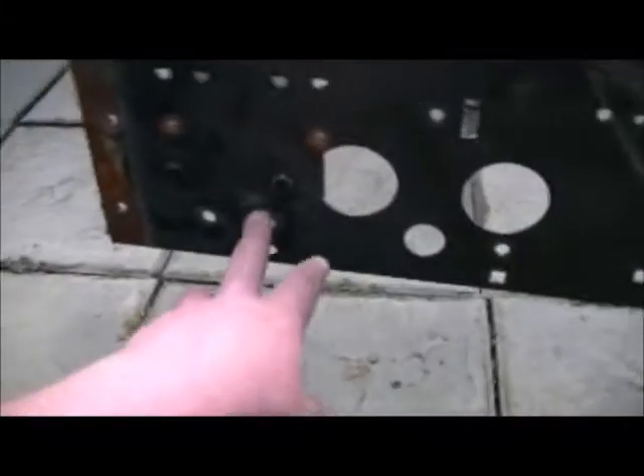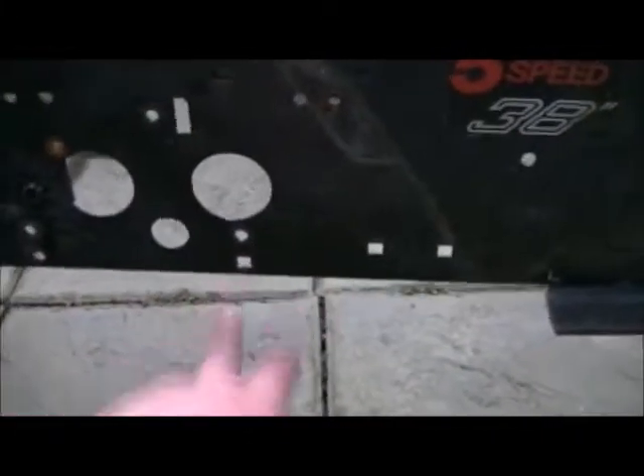The reason why I had to cut the front so short is because of where I'm putting the rear end. The stock rear end for this would have been these back holes. But on these tractors, you can put the rear end in one of two different locations by drilling just three more holes. The bracket uses these three holes here and these two holes right here. But what I'm going to do is the back bracket is going to go to these two holes right here, and I'll re-drill the front holes for the support. What it's going to do is shorten up the wheelbase a bit but keep it sticking over the back. And I think it will have better weight ratios, and you'll be able to lower it down more — and it should take care of any flex in the middle.